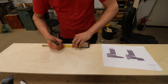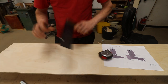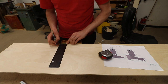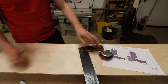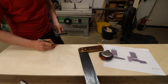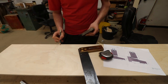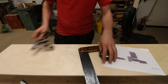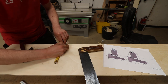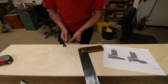There'll be a 70mm overall, 12mm section there, and 15mm rebate. I'm just going to lightly pencil these lines in. That one can be a bit stiffer. So there we have. That section is the fillet of timber to make up the extra height. And then we've got our 58mm of sill. For the rebate, so basically drawing what I've got in cross section there, but onto this board to make up a cross section, full size rod drawing for a reference on all my sizes.